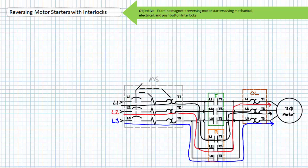The reversing contactor is wired such that the applied phase sequence seen by the motor is L2, L1, L3. When the reversing contactor is closed, this would cause the motor to rotate in the counterclockwise direction.